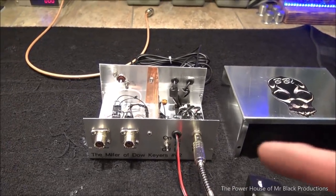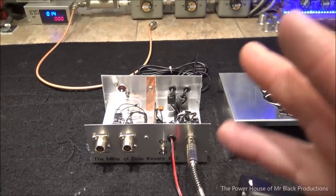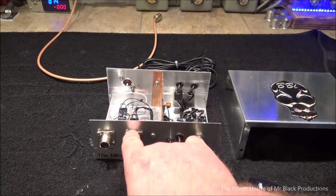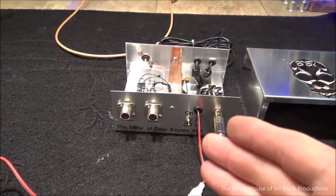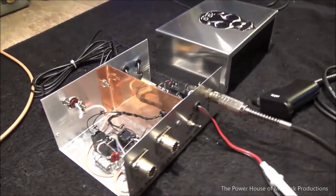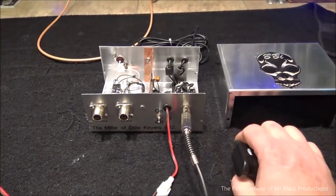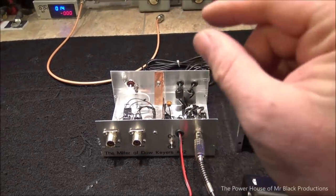We could probably add a capacitor on this relay here to slow down the transmit-receive switch that's taking place, and you do it on the 955 side, so it helped buffer the latency on the time for the Icom side. But Mr. Steve, here you go, brother, the mother of all Dow-keys, and it'd be a radio switch as well. Because the Dow-key, all that does is shift the antenna. Where this is a trigger control and an actual control for the radios. And that sequence is what makes it so crucial.